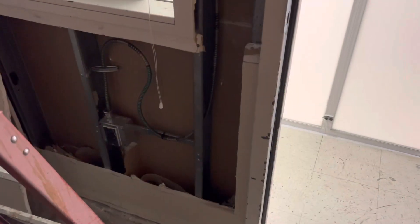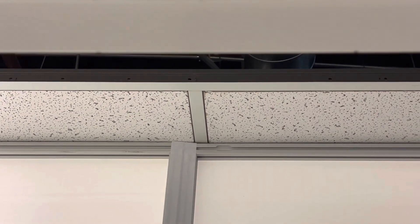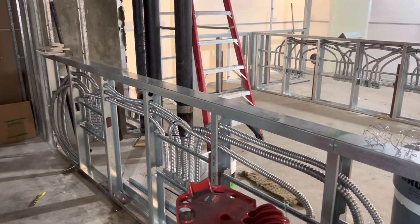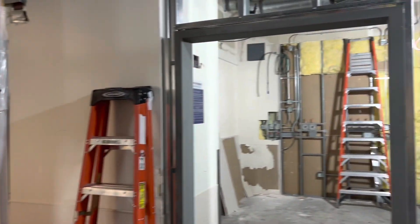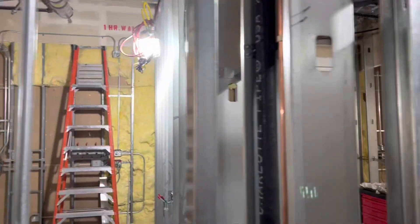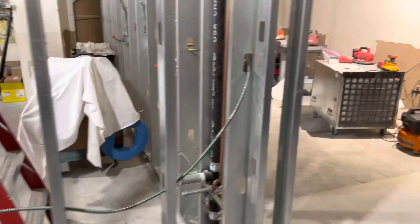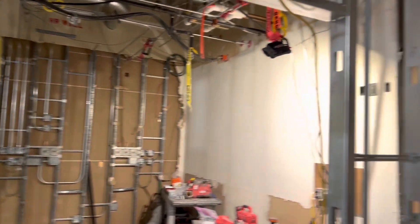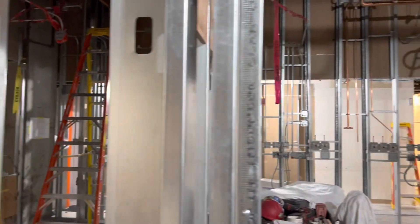Hopping back into the inner waiting area where we've done a little bit of work. We pulled out the wire going back to this last junction box, so now we can reuse that pipe when the time comes. Off to the right there is this nightmare of flexes - they did a good job but there's just so much going on. Moving on, we've got a whole bunch of box layout for all the patient rooms. There's going to be copper lines for med gases and stuff like that - not all of it is ours, but obviously the stuff with the wire and the EMT is. All the rooms are basically mirror images of each other. All I've really done in this area is fire alarm, data, and demoing some electrical.